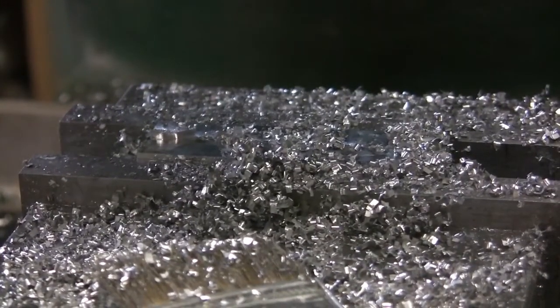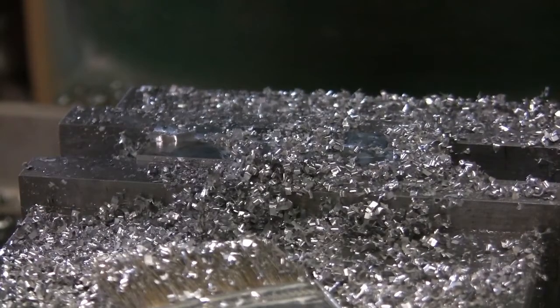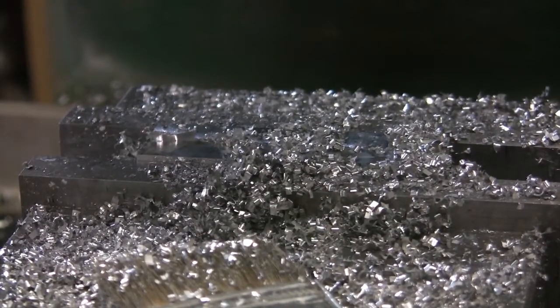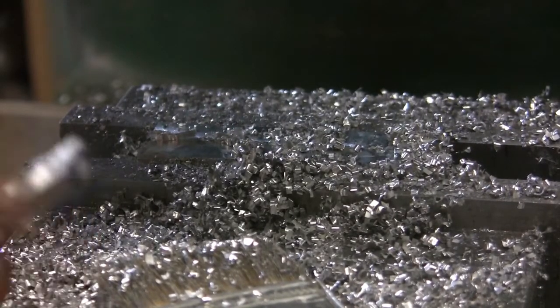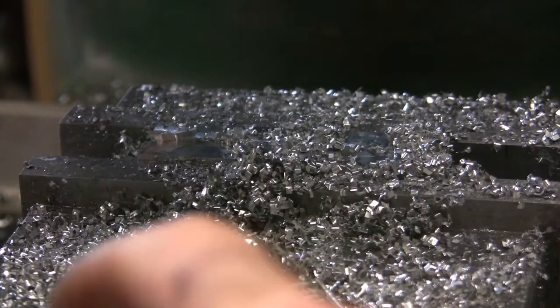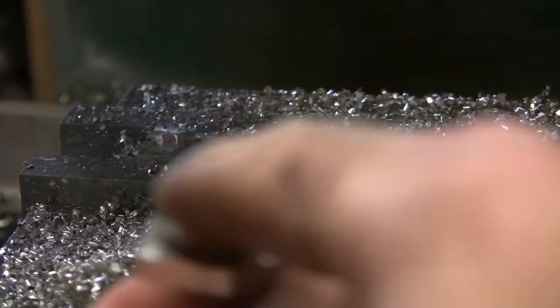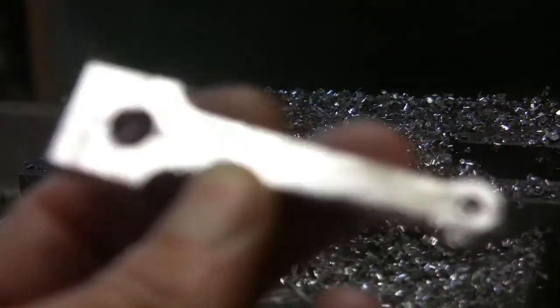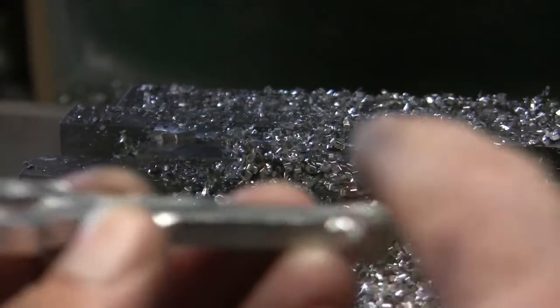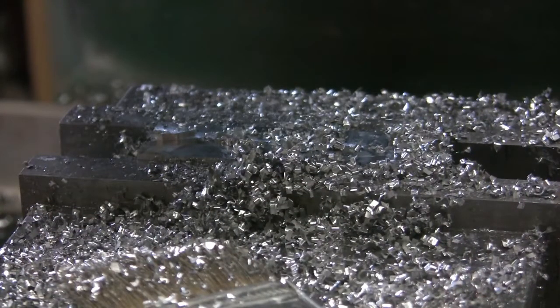I'll load the other side up and do the exact same thing. I'm going to cut away here and I'll be back when I get that done and them cleaned up, and I'll be back when I get a fixture built. What I'm going to do is take and build a fixture that just loads with a shoulder screw in this hole - in the 3/8th hole - and a 3/16th screw to hold it in place. I'll be back.